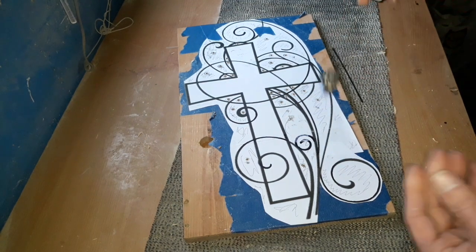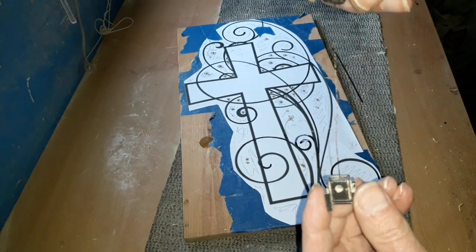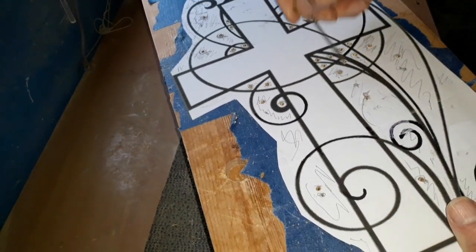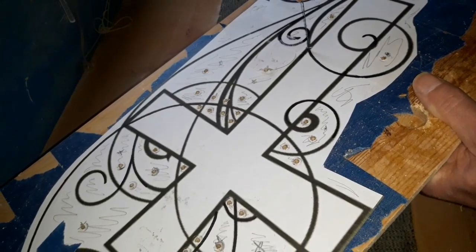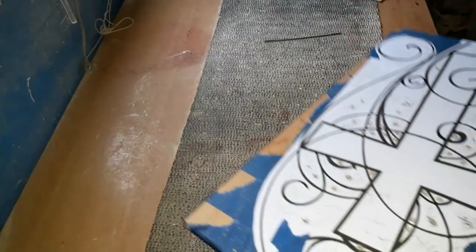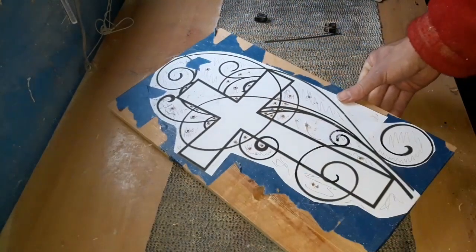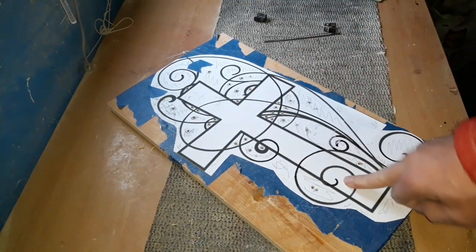Pin blades and straight blades only cut at the front - they're identical apart from the missing pin. Spiral blades are really thin and can cut from any angle, so once fed through you can go up, down, left, right, whichever direction you need. With a pin blade, if you're cutting along and need to turn a corner, you'd have to rotate your entire piece of wood around. With the spiral blade you can just go in any direction freely. I'll stick with the spiral blades for now - they're not ideal for straight lines, but practice makes perfect. Let's get this set up on the saw and start cutting.